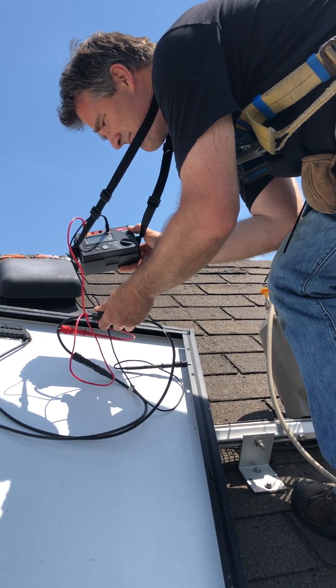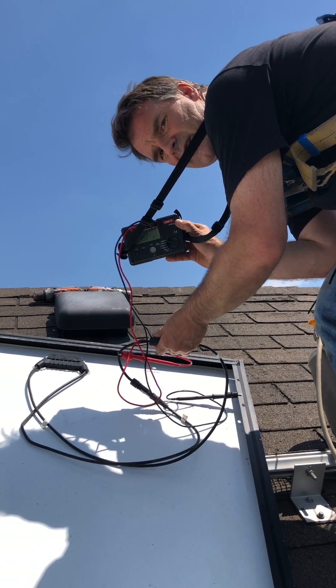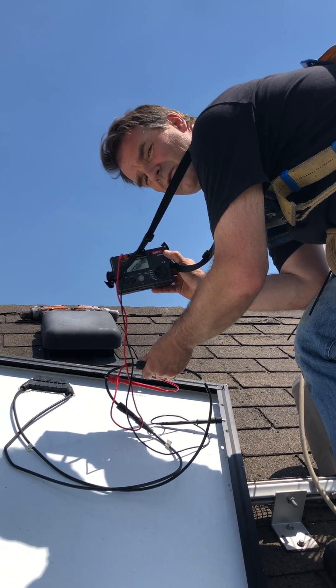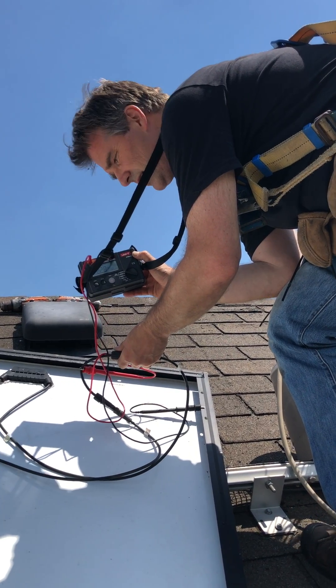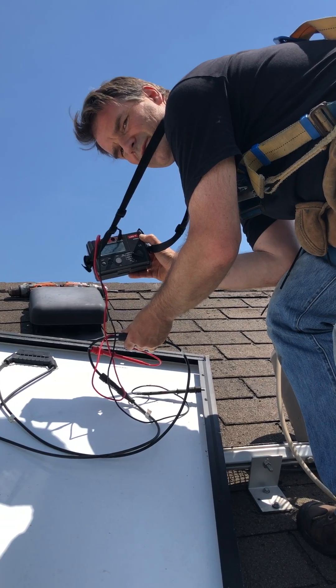It's reading and climbing — it's 140 megaohms. This is at the thousand-volt reading. This is a good panel; anything over 40 megaohms is a good insulation result between the panel circuit and the frame.